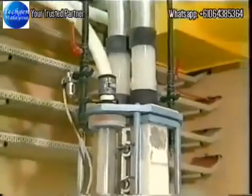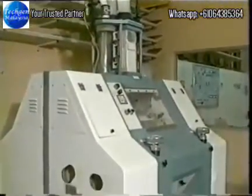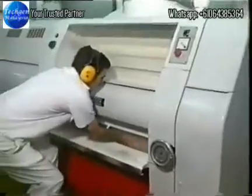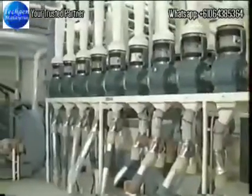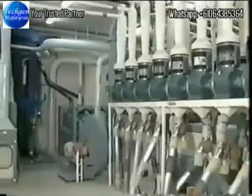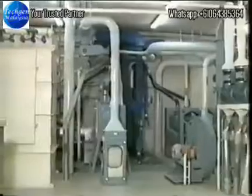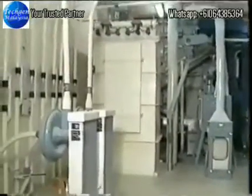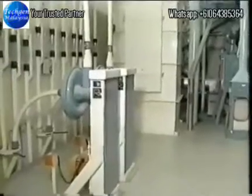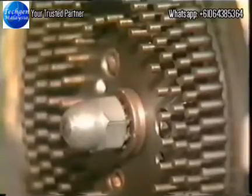After removing as much bran contamination as possible, the endosperm particles are progressively reduced in size by passage through a series of smooth or matte surfaced reduction rolls, sieving after each step. Flakes of endosperm, formed by passage through the smooth reduction rolls, are broken up by passage through pin mills or flake disruptors before sieving. The pins, rotating at high speed, break up the aggregates.